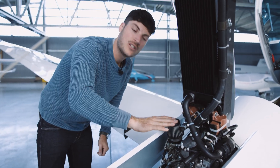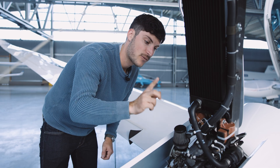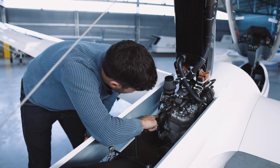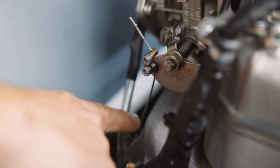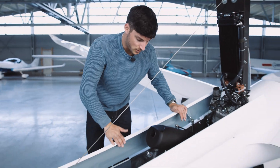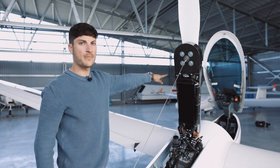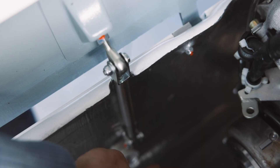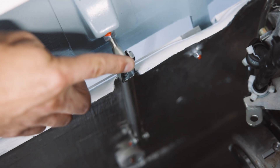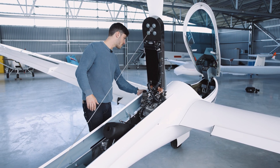Check that the air filter is secured properly and is fine. If it is dirty you need to clean it and assemble it again — that's very important before you fly. Here we also have the Bowden wire for the gas lever, which is really important. Then there's one more button to check — press it and you should get a failure message at the SDU. Then we also check the linkages for the engine doors — engine doors are also not damaged at the front side.